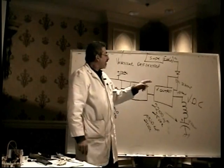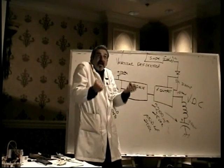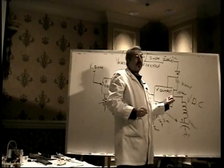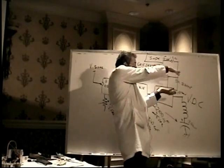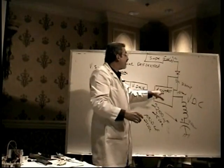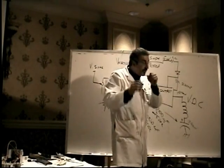As you're doing that, you're causing this vertical output chip to work really hard to compensate for the fact that we don't have the right voltage. It has to pump a bunch of current through the yoke to compensate for the fact that the original voltage isn't high enough anymore, and that's what blows that chip. It gets really, really hot, and it blows that chip.